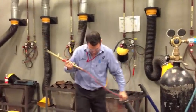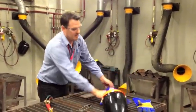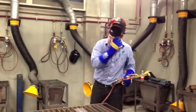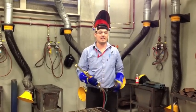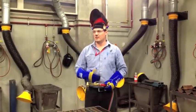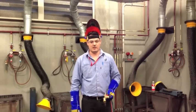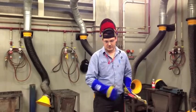Just make sure there's no kinks in the line. The oxy-acetylene setup is very handy around the house — for things like cars, frames, and basically just cutting a lot of steel. The reason why I use oxy-acetylene a lot more than a grinder is grinders are noisy, they're dusty, and consumable-wise you go through quite a few discs if you had to cut something of 10mm. However, the oxygen bottle might cost quite a bit to set up, but once you've actually got it set up, it's good to go for a long time.